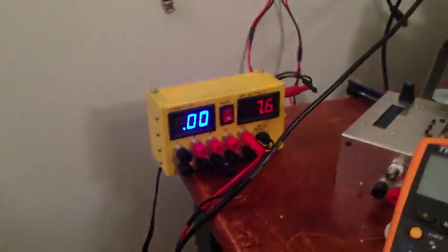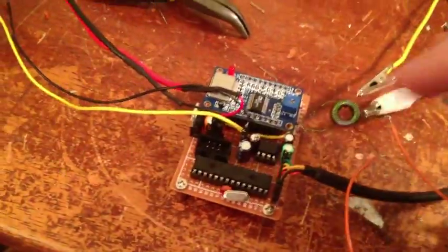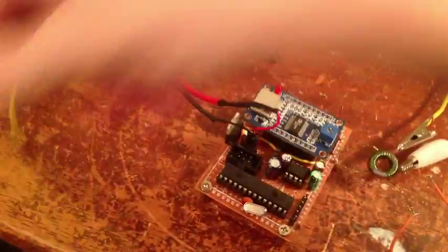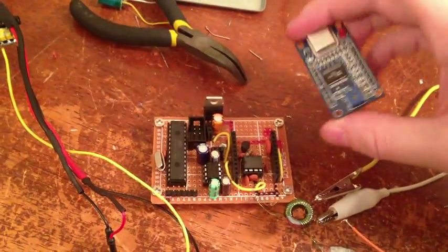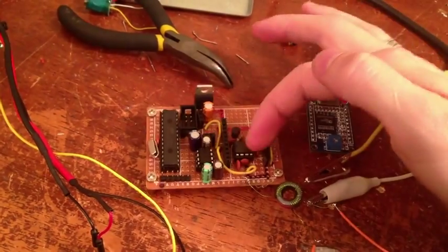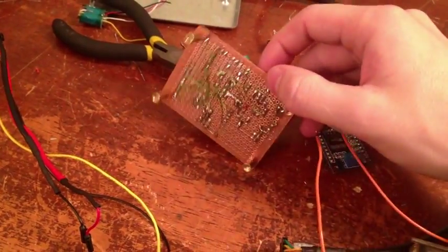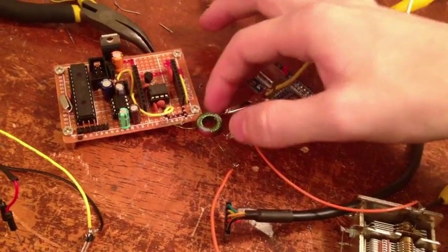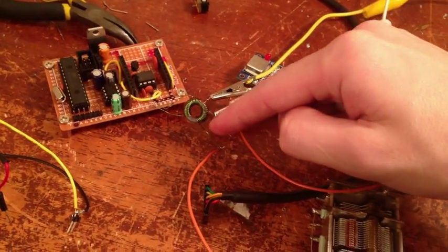This is being powered by about 7 volts from the power supply. This is one of those FTDI cables I talked about, and this is the connection to the audio. This is kind of clever — I made this interface board to stick right there. Beneath it we have the mixer: SA612 and LM386. We've got some magnet wire on the back. The antenna is balanced coming in; it goes around a toroid that has another winding, which is the tank circuit — just the inductor and the capacitor — and then a third winding goes to the input of the SA612.